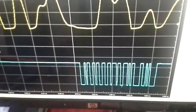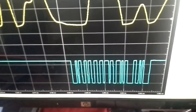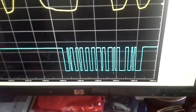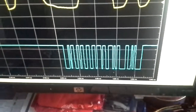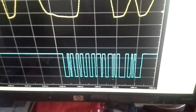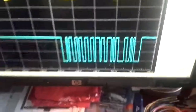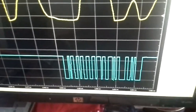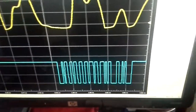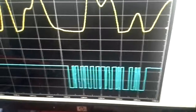You can see that the digital signal goes low, which is the start bit, and then a progression of numbers 0 to 9 progresses through this signal. If we were to decode this, we would see that from the least significant bit to the most significant bit is displayed, and then it has a stop bit of 2 ones, and then of course a start bit of 0 for the next number, which is then shown. That repeats until we reach the end, where the signal goes high again, when the microcontroller is ready to output the next number.